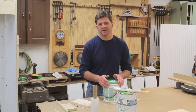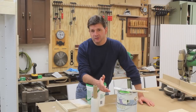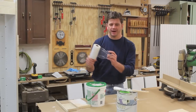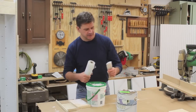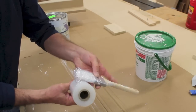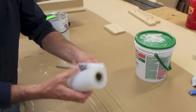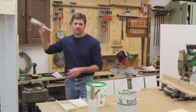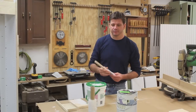It's just faster drying and easier cleanup. One quick tip when using latex paint: it's great to have one of these rolls of packing wrap around. What I like to do between coats of paint is wrap the brush up — that'll keep the brush wet and usable for a couple of days. I can put a couple of coats of paint on and then come back three days later and still use the same brush. So that's something I do all the time.